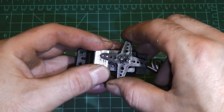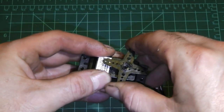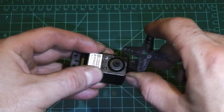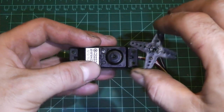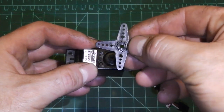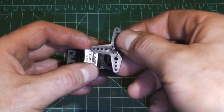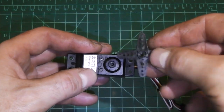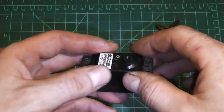First you want to carefully remove your output shaft. By the way, this servo is good — this was on that old plank, the old SIG. The servo is good; this was the rudder servo. Go ahead and take off the output shaft carefully by wiggling two sides, get on two corners, or use the screwdriver method I showed you in the quick tip. Set that aside.